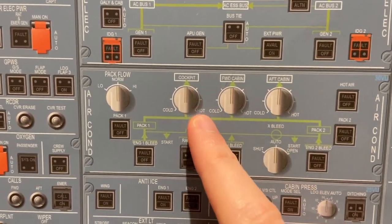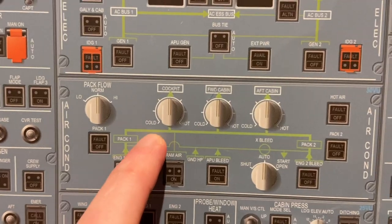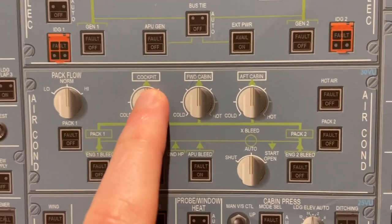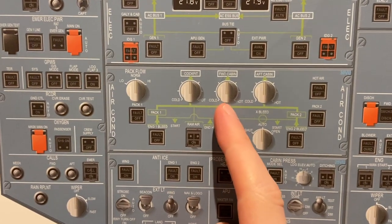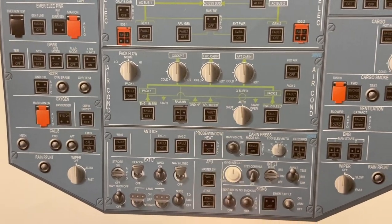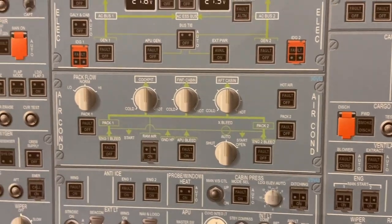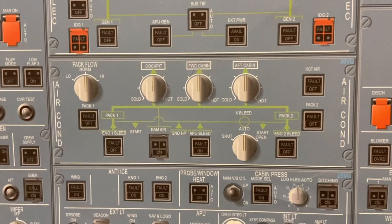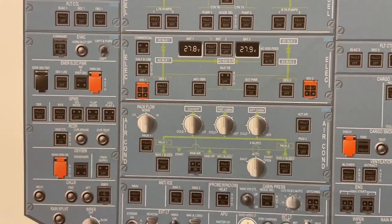And this is how we make it so damn cold in the cabin — we usually keep it around the middle. The way Airbus has set it up is the coldest is 18 degrees Celsius, the hottest is 30 degrees, and smack bang in the middle is 24 degrees Celsius. But the cabin crew have the ability to adjust our set temperatures plus or minus 2.5 degrees. Over here we have hot air — this is how we can stop hot air from being supplied to the trim air valves, which adjust the temperature accordingly into each zone.